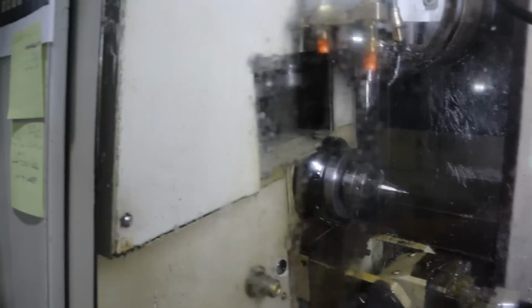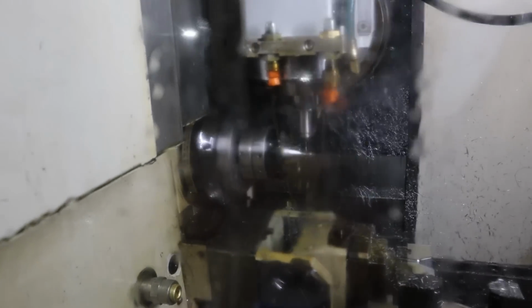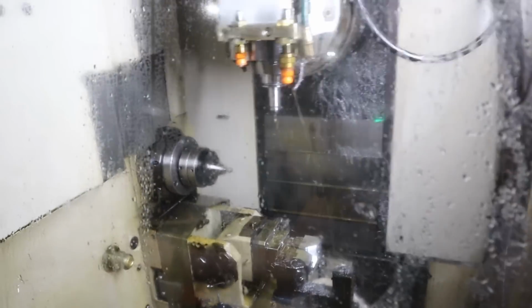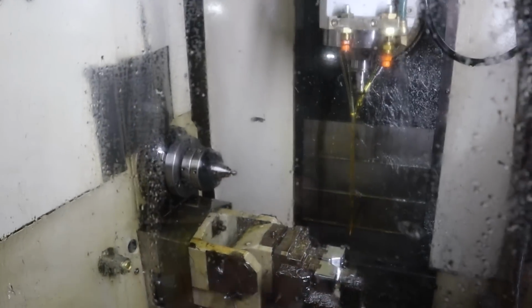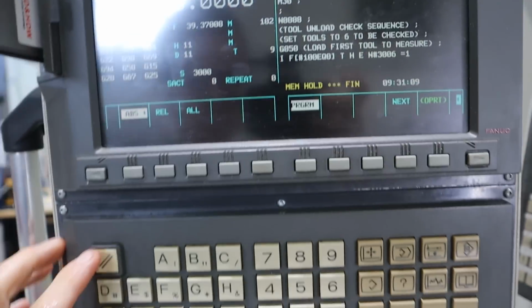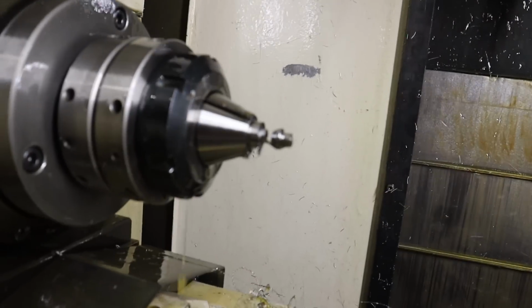All right, tool change. Now's our high feed. I'll send it, whatever. Oh, look at that thing go. I freaking love high feed end mills. That's it. Tool breakage. Goes between the laser, sees if it's broken, goes home, does all its dance, waits for 5 seconds, and then it alarms out and says, hey, I can't make the next part. Look at that, it held.